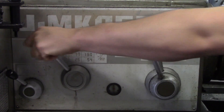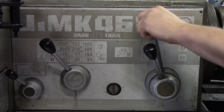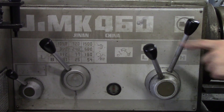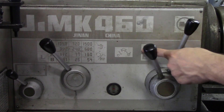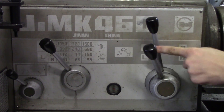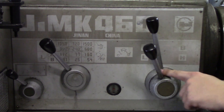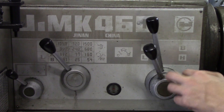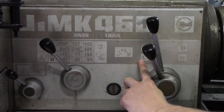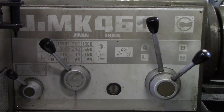I'm going to go to 1050, so I put it on H. I need to be on A to get to 1050, which is this back handle — at the base it has A and B, and at the top panel it also shows A or B. I position the handle towards A. I'm in high gear, so on the base of the front handle — H and L — I move it from low to high. Now I'm at 1050.